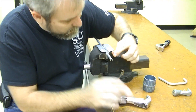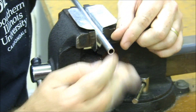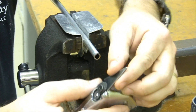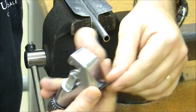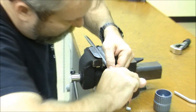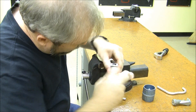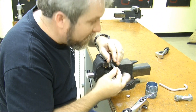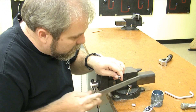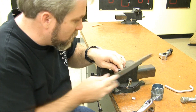We've cut the piece off the tube, and you'll notice when you look real close at the end it made a beautiful cut, but there is a little bit more of a burr. Most tubing cutters have a deburring device built right into them, so I'm going to demonstrate the use of the deburring device here on the tube. We're going to stick that into the end — it's actually just a reamer. I'm going to stick it in there and ream the burr out of the end of the tube. I don't want to do it too much or I'm going to distort the tube, but that'll do. Now once again I want to finish it off perfectly flat with my file. That reason it's got to be flat is for when we go to flare the tube, which will be in the next video.